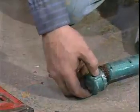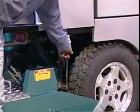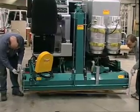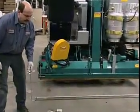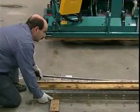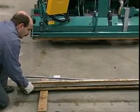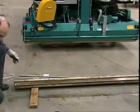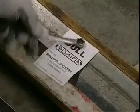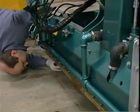To prevent corrosion in the water system, remove the end caps of the flood pipes and flush with water. Drain and flush the water tanks and leave all the drains and valves open for storage. During the off season, the blade should be removed from the conditioner. Make sure you are wearing protective gloves when removing the blade. Check to make sure the blade edge is sharp and there are no nicks. Have the blade sharpened if it is dull or nicked before storing for the off season. Carefully clean the blade with oil and store in the wooden blade sheath in a dry area. Check the blade holder surface on the conditioner and lightly oil the blade holder.